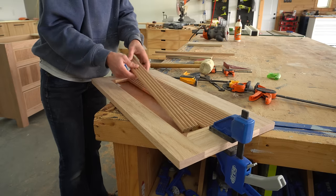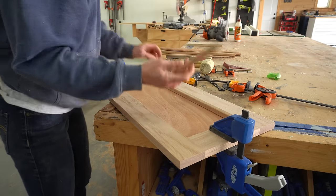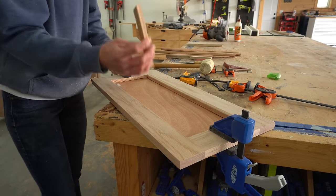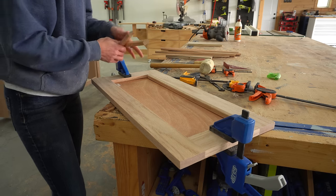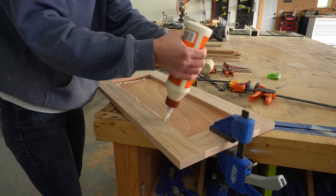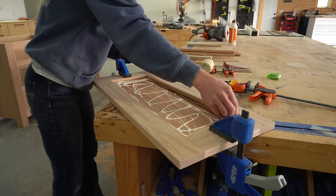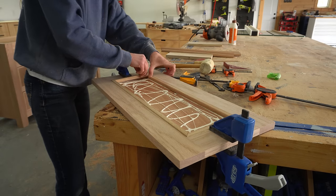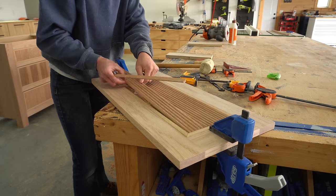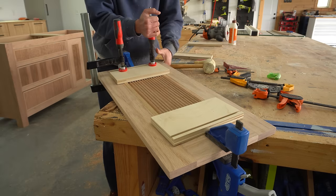I glued the plywood panel in place with the uglier side facing the front, then decided to add the fluting on the front of the door. I did this just like the drawer fronts except it sits inside the frame. I used the pieces cut off the fluted trim for the framing, then cut the fluted trim pieces to fit inside. I cut and test fit all pieces inside the door frame first, then glued them in piece by piece. I had to carefully rip a tiny filler piece to fit on one side, then clamped everything tight and allowed it to dry.